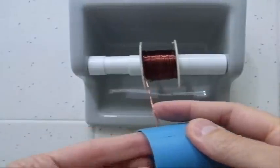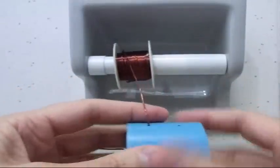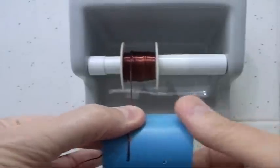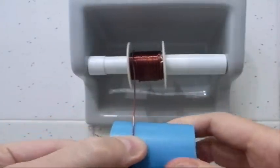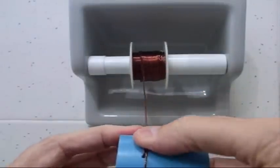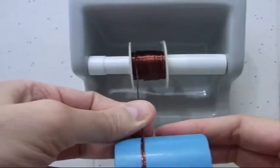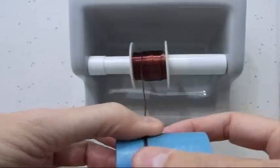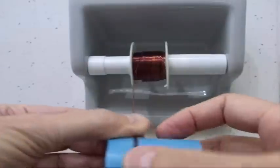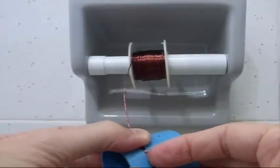Get yourself a pretty good length of wire — maybe six inches out — just bend it over sharply in there like that, and then start wrapping it nicely. It doesn't matter which way you go. The first turn is very important because it's how everything else is going to fall — if it's crooked, all the others will be crooked. You want it to be tight and straight. If you see a gap, that gap is no good, so push them together.